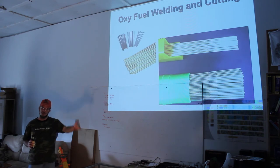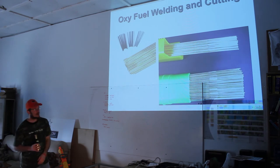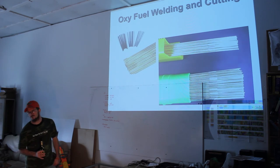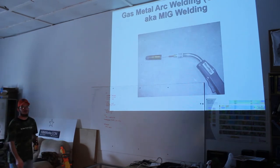Otherwise, if you just try to weld the top, you're not going to go all the way through. You're going to have a perforated or semi-scored piece of metal that's just waiting to bend. So you mean grind it down, give a little bevel on that? Yes, and you keep your bottom half the same precise length that you need. You just bevel.